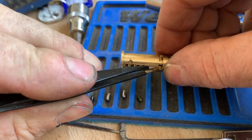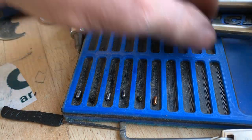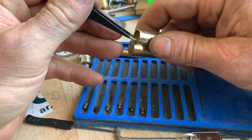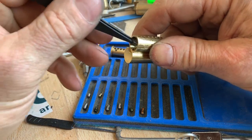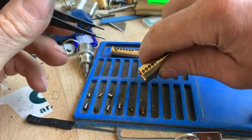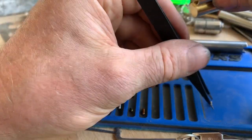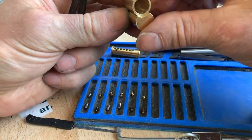Five is too short for a serration. Number six — we've got some nice colour pins in there, a couple of black ones and a red one. It's a standard lock. Number one: steel standard. Two: spool. Three: spool. Four: spool — nice little spool actually. Five: spool, and six: there's a spool. Sweet little mixture of pins in there, all standard springs.